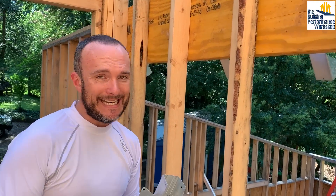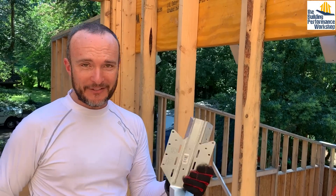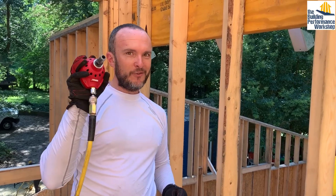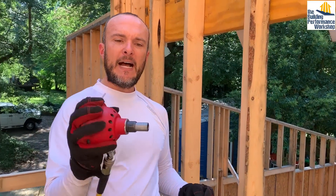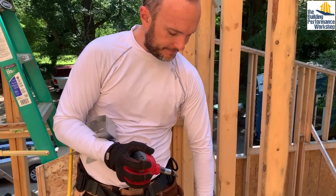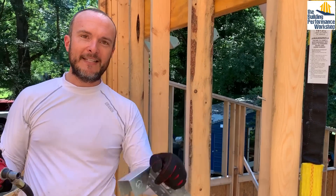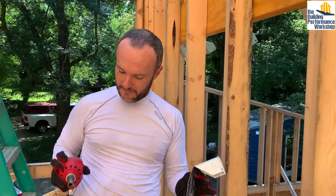To put this on I need 19 one-and-a-half-inch nails — that's a lot of nails. So I've got my nails in a little baggie on my leg when I'm out there. The important tool is this: I found it on a YouTube video by chance. It's called a pneumatic nail driver or palm nailer — it weighs about two pounds. You put a nail in the end, it's magnetic, and you just start driving nails into things. If you're hanging things with hangers like this and you don't have one of these, your life is going to be hell. I can do one of these in less than a minute.